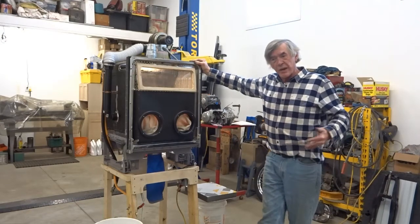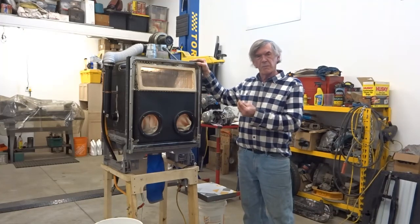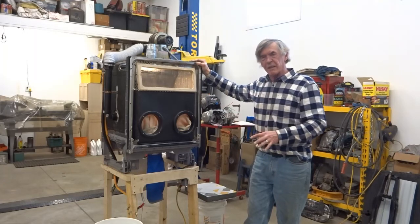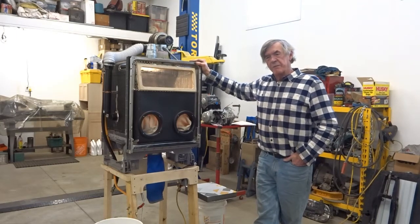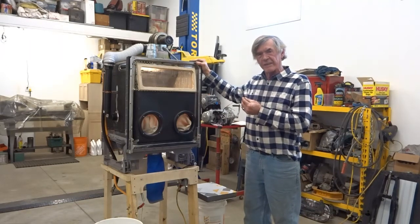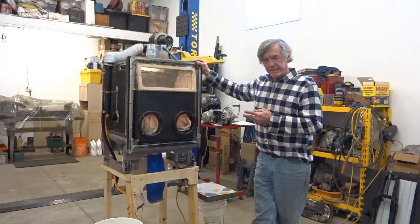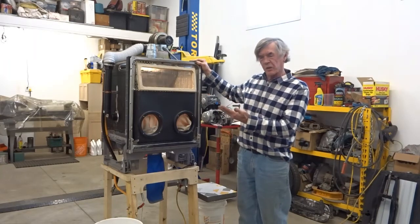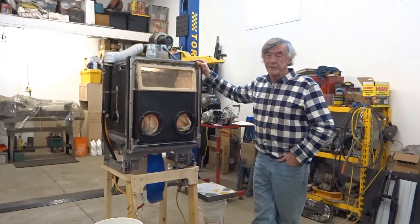I didn't know anything at all about the process. I'd read about it - it's magic. Sandblasting is a dry process where they blast fairly aggressive crushed media - could be glass, could be slag - and it takes off paint, takes off the top surface of the metal, takes off your serial number if you get your frame sandblasted. It's just a bad thing for delicate parts. Vapor Blasting is the process of projecting glass beads, somewhere around five thousandths of an inch diameter, against the aluminum. Usually you're blasting aluminum parts, sometimes pot metal carburetors. What it does when it impacts the metal, it peens it. You end up with a piece that's shiny, looks like the original casting. It's a glorious process - I also saw other people's crank cases that had it done.